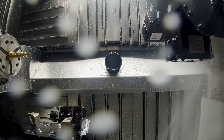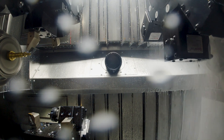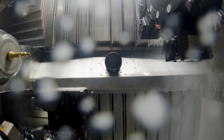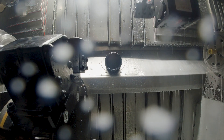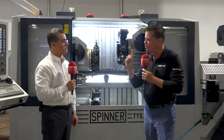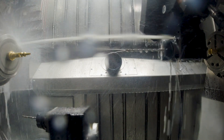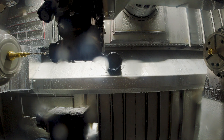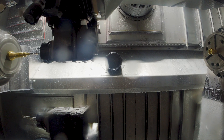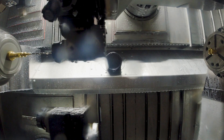I like the term 'endless,' and you are a legend in the industry. You've been doing this a long time. You've already mentioned pinch turning. Can we dive a little bit into the concept of pinch turning just on op 10, because obviously op 20 can be running on its own also? Let's talk about pinch turning and what that does for anyone who's learning about it for the first time. There are two kinds of pinch turning. One is you can be doing roughing and finishing at the same time — one tool is trailing the other. The other is you can be using both for roughing at the same time. You can support the part — even if it's a long part — because you're compensating for the pressure of one with the other one cutting at the same time. That's what allows you to do longer parts and be more efficient than the competitor.